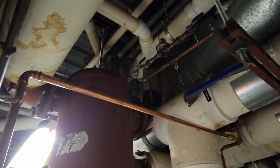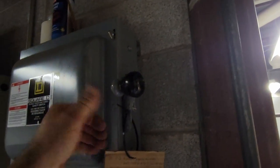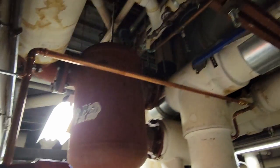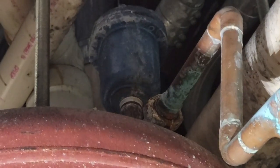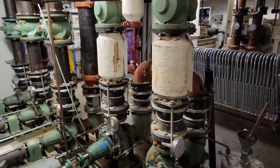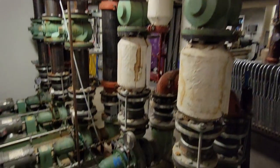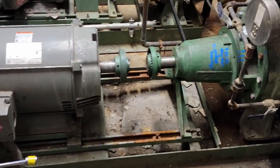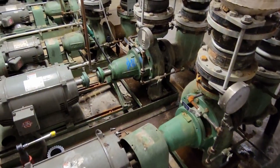This here is like a transfer switch — it allows either one pump or the other; it's a double throw non-fusible, so only one can be powered. You can hear the bleeder up there. My thought was we'll go ahead and slowly make sure I got all the air out as much as possible — you're going to get some unfortunately. Next thing I've got to do is get a straight edge and get this thing leveled up. I did not mess with any shims that would have been in the motor.